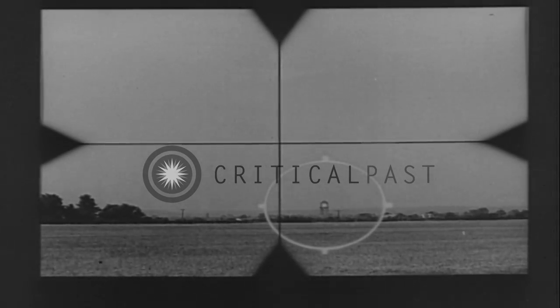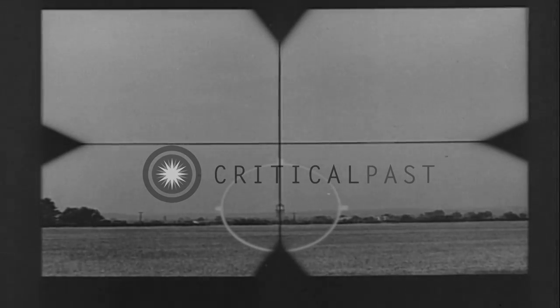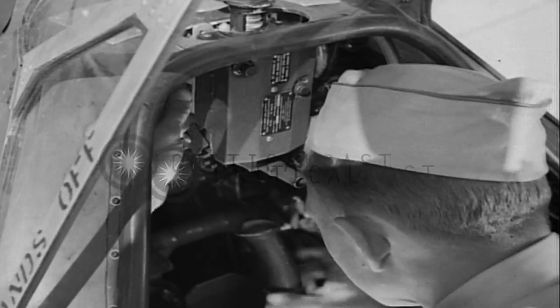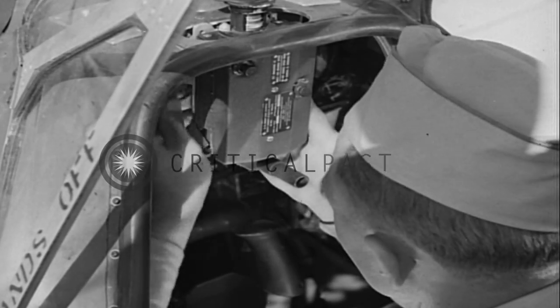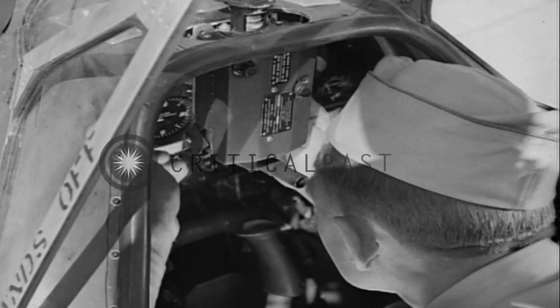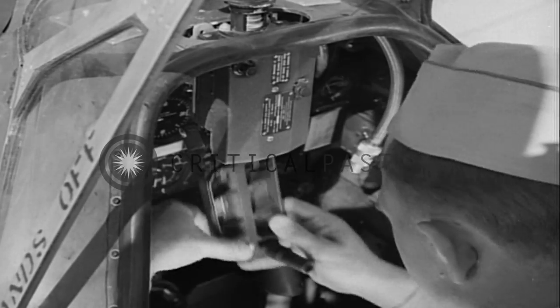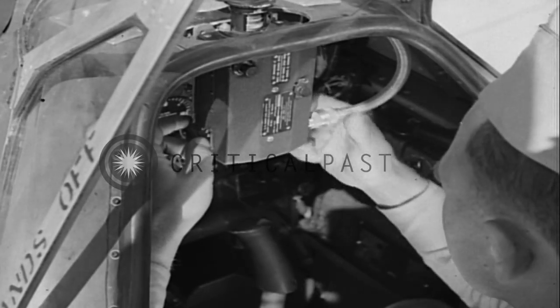Move the camera until the crosshairs of the sighting tool fall directly over the dot in the reticle image. It's not necessary to center the camera behind the sight — you can place it down in one corner where it won't obscure the gunner's vision. When you're lined up, tighten the bolts to hold the camera firmly in position. Make the electrical connection and the installation is complete.